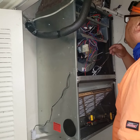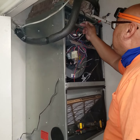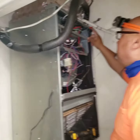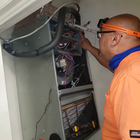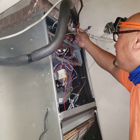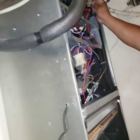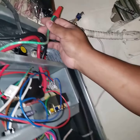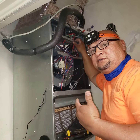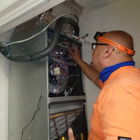No wire nuts. They're using a ground conductor — a green conductor — which I did not find used for a ground. If they were going to do this, it would have been fine, but they didn't phase it or identify the conductor. And they're using a red wire nut, guys. They're going from a number 6 conductor to a number 10, and every wire nut is sized for a conductor. So this is not a good connection.